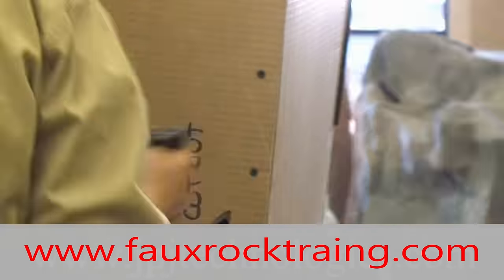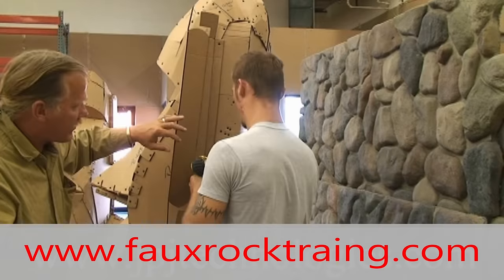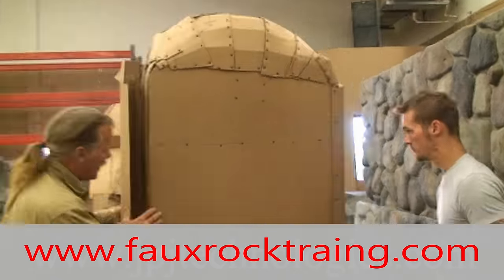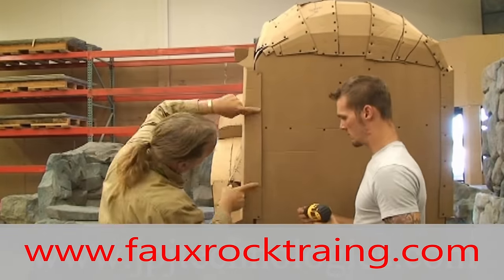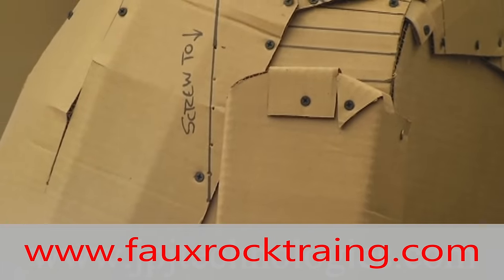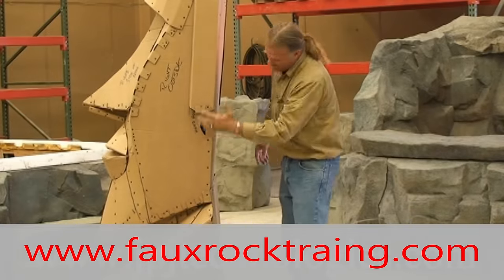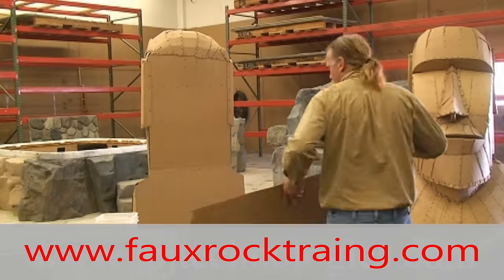You're going to see me tape a little bit because I said I wasn't going to seal it, but then I decided to seal the cardboard so that it wouldn't get wet. If it gets wet, it loses its rigidity and would collapse potentially if there was wet cement put on it — the cardboard needs to be sealed.